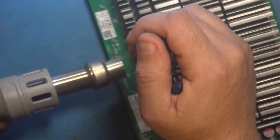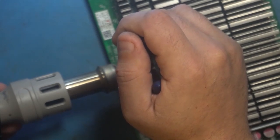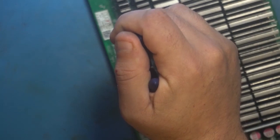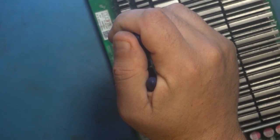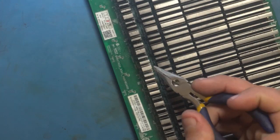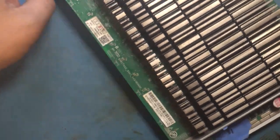Okay here we go. I keep heating it, position it in line with the other ones — right about there. I wiggle it and I feel it flush, so I take the air off to make sure I don't melt the solder of the chip itself. You don't have to apply crazy pressure, you just want to hold it flat. I turn on the air, slowly release the pressure — seems to be solid. And there we go. I realized my hand was in the way for that last part but that's all I could do unfortunately.